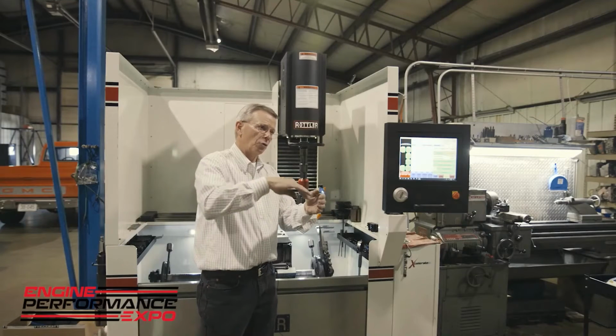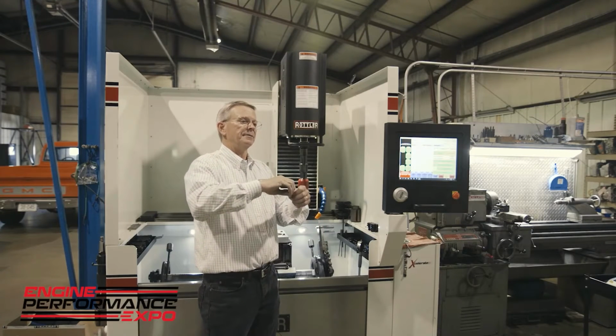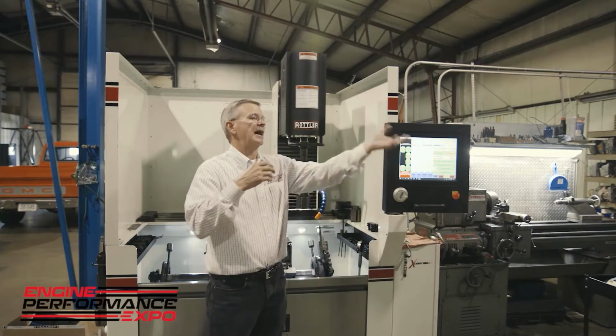like a rock in a stream. The water's rushing against the rock, and it begins to hollow out underneath the rock, okay? And the more water rushes by, it continues to hollow out until that rock finally gives way and it rolls off into another spot. That's exactly what the honing process is like. So as we're honing, the slurry and all of the pressures are eroding below that diamond, and once it gets to a point, that diamond breaks away and exposes a sharper abrasive to continue the cutting process.